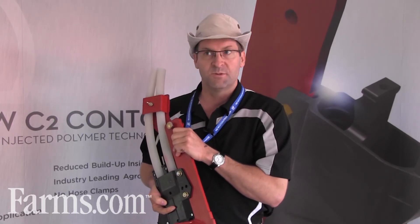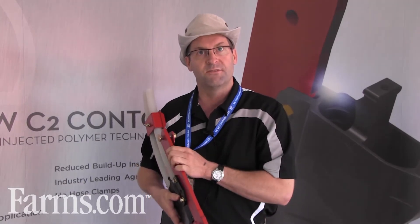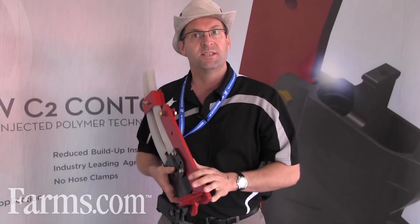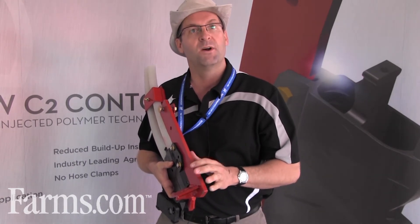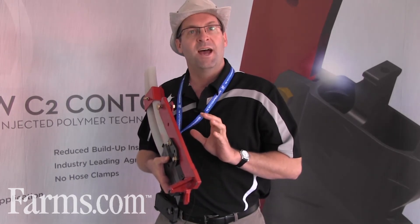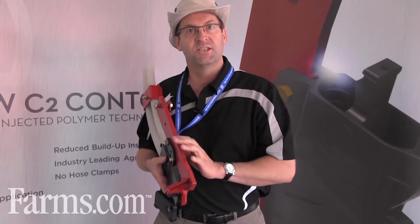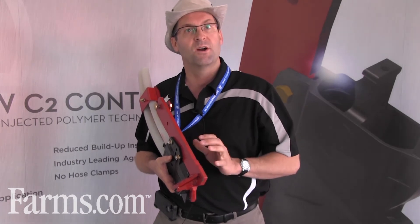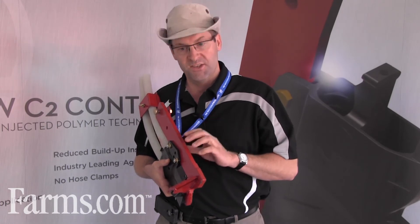There are also enhancements to the redesigned steel in front of the opener. These openers have always had stellar performance when it comes to fertilizer-seed separation, and we wanted to maintain that while also improving wear life. This design has moved to a one-piece design and we've added 32 percent more carbide to the surface, specifically targeting the high-wear regions of the opener.